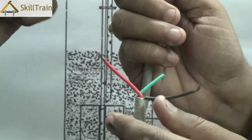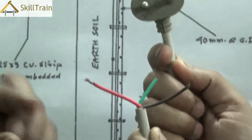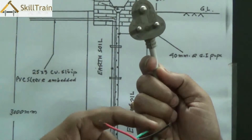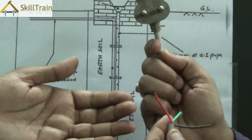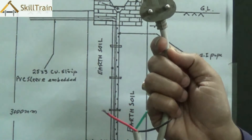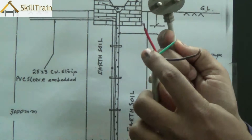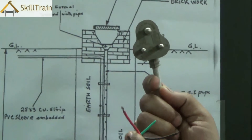Normally these points have three colored wires — red is the phase, black is the neutral, and green is the wire that signifies the earthing wire. We also saw this green wire in the board where we opened up the board and understood how the earthing is connected there. Because of the earthing present in any equipment, the excess or leakage current is directed to the soil, thereby keeping the equipment safe and keeping the human body safe as well.